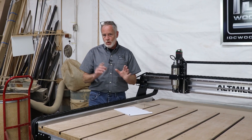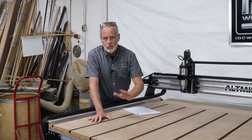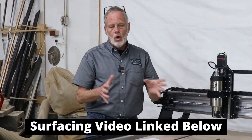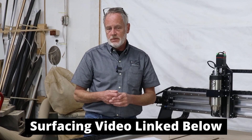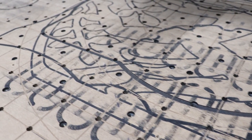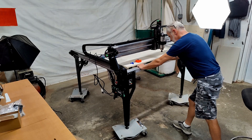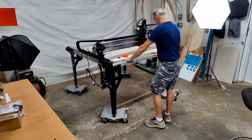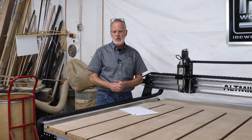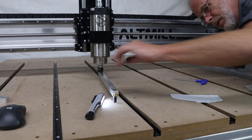At the end of the day, here's what we've got. When you get your CNC router, you always have to surface your spoil board first before you carve anything — I've got a video that shows you exactly how to do that, linked below. Over time, you will probably have to resurface your spoil board. Number one: if you make too many cuts into the spoil board it can start to throw things off, so check it and maybe resurface it. Number two: if you move your CNC router, you are definitely going to have to recheck it and possibly resurface it. Number three: if you're in an environment with a lot of humidity fluctuation, pay attention to your spoil board because it will swell and contract over time and throw itself off.